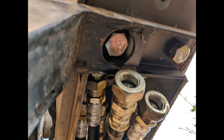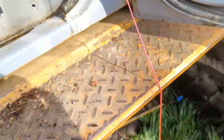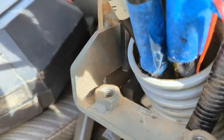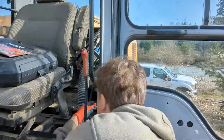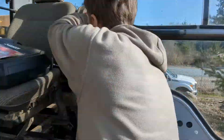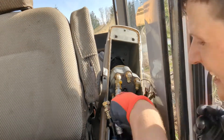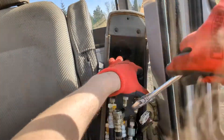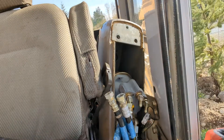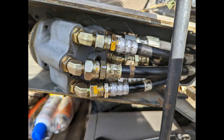For me, I had to take off the two front hoses because I needed to get to a hose in the back of this compartment. When I took off the hose the first time, I attached a string to it as I pulled it through, so I could pull the new hose back the other direction. That was an idea from a friend of mine and it worked perfectly. Getting in there and making these changes is very difficult until you get that component pulled out. I strongly suggest you mark which hose is which and which one goes where. I did try to mark them with blue tape, but the hydraulic oil rubbed my pencil markings off. Fortunately, a photograph I had taken earlier allowed me to figure out which hose went where. So I suggest taking pictures as well as making notes so you can keep track of where things go exactly.